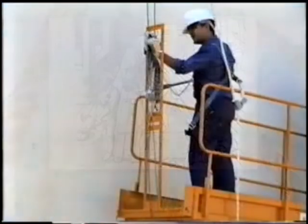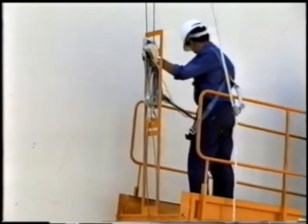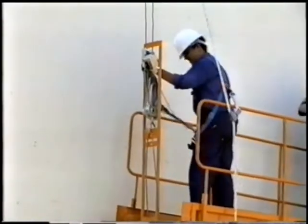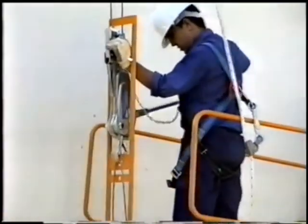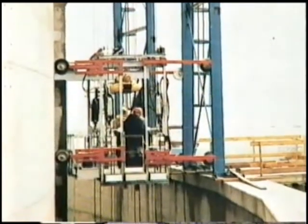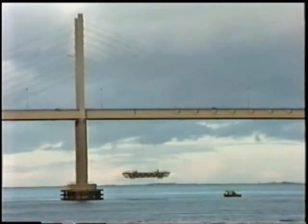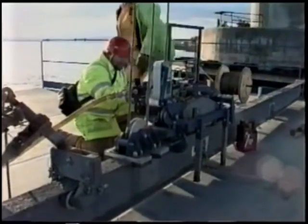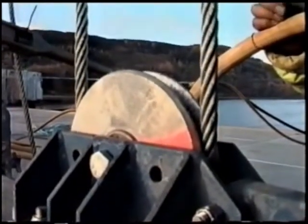The Tirfor machine is approved for lifting people. It is the proof, if any is needed, of the confidence which you can put in the real Tirfor. Used in conjunction with our block stop fall arrest device, the Tirfor is used around the world by many fleet operators for suspended working platforms and cradles, heavy platforms for pre-stressing, chimneys, cooling towers and bridges. For such applications it is the incomparable weight to capacity ratio of the Tirfor which makes it suitable for a suspended platform: 100:1 for a Tirfor, often compared with 5:1 for a drum winch fitted with its rope.